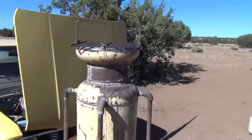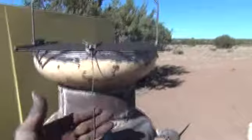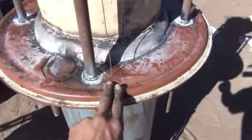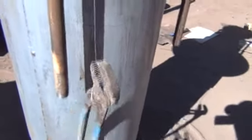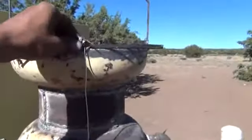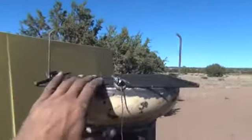One final thing before putting it inside the barrel — that cable going up here goes to our grate screen. It's a gravity-actuated grate screen: the cable runs through a very fine hole in the lid with almost zero air leak. Right now I have some weight hanging on it; I'll put a hook on the tank once it's inside the barrel. Those little prongs stop the grate from going too far and guide it back up.